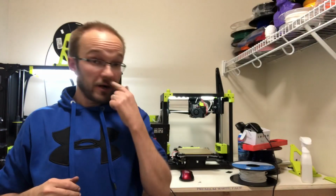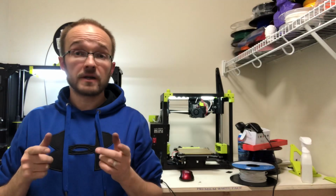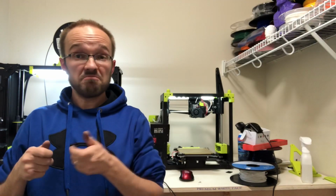Okay, so I powered it up and everything moves freely. You'll notice when you first change the bearings out in any direction, they're going to be pretty tight along the rod. They'll break in and things will start to move more easily. Stepper doesn't seem to have an issue driving it. I did have to go back and tension the belts a little bit because the belts have stretched. Other than that, it went back together.